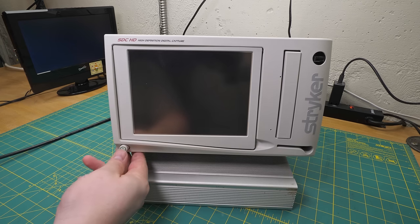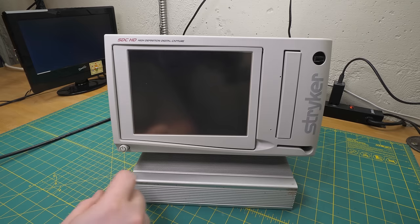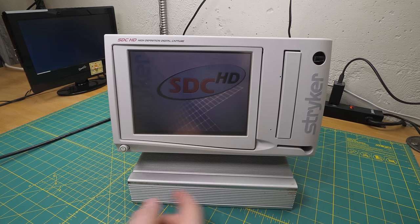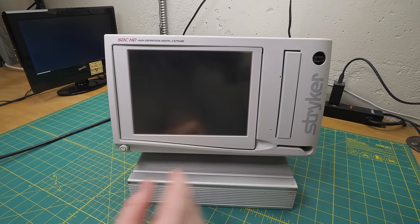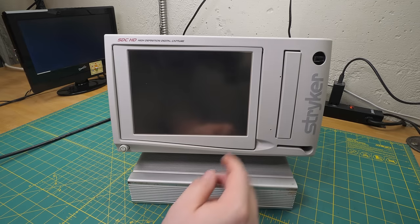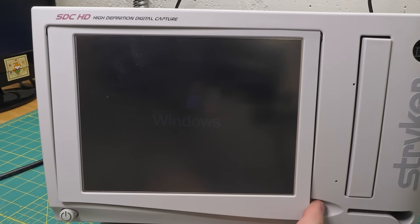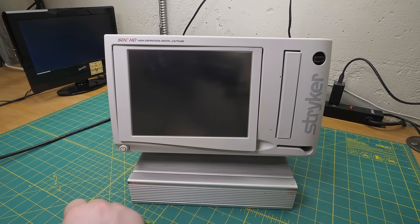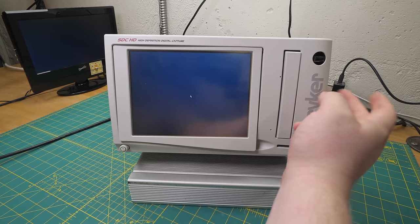I have concerns. There's no picture and I had this happen when I tested it before - I basically just opened it up and jostled some things and was able to get it working. Okay, it just wanted to be rebooted. It seems like when you turn it on from a cold power off it has a tendency not to start up on the first try. Man, that screen starts out real dim - this is from the CCFL era. Unsurprisingly, we've got XP Embedded on here. You can tell it's XP Embedded because it loaded that fast off a spinning hard disk.